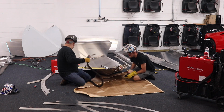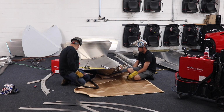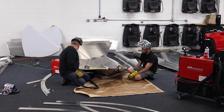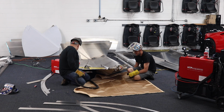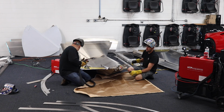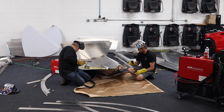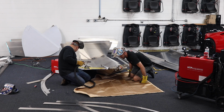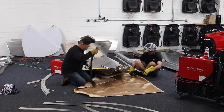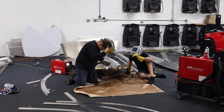You see, the first day there were real efforts made to protect the carpet. That later on kind of fell to the wayside, because no matter what we did, there was just no way to protect all the carpet. And then what we do here is we weld in 6-inch increments, like backstepping it to mitigate pull and to get a good weld, running like half an inch into the previous weld, 6 inches at a time. So that worked out pretty good. The welds actually looked decent.